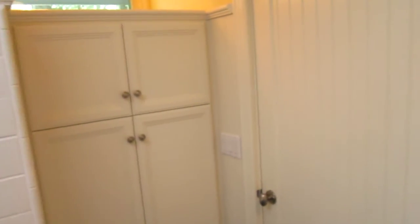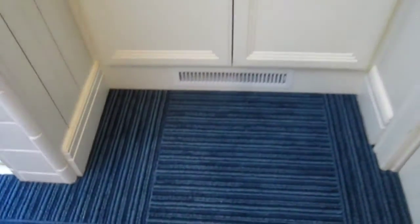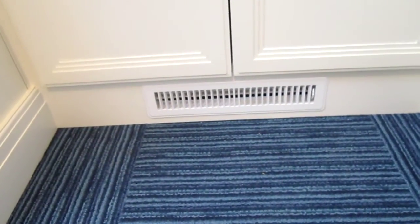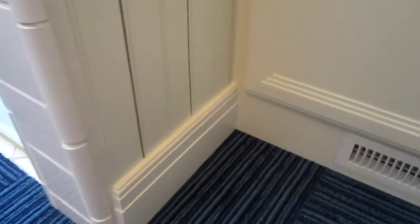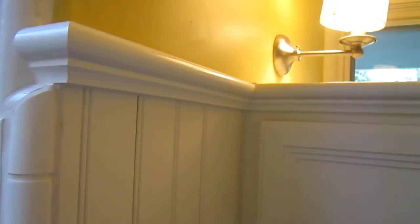So this is the finished product. We made the large opening at the bottom for the keg. We incorporated a 2¼ by 14 vent at the bottom and brought the floor vent up through the bottom rail. Built it right in, scribed it to the walls, and then wrapped matching top trim around the top.